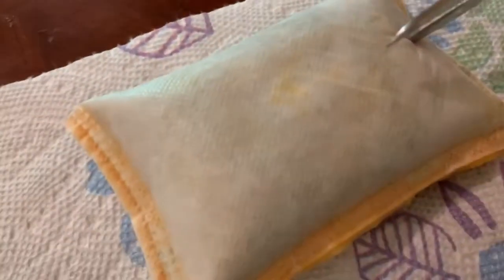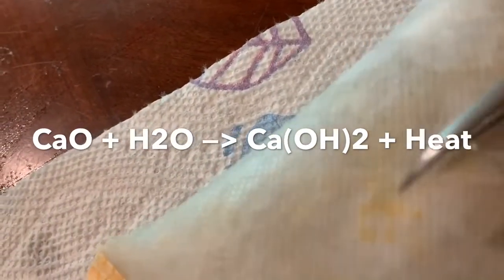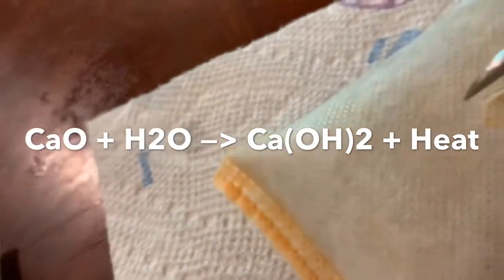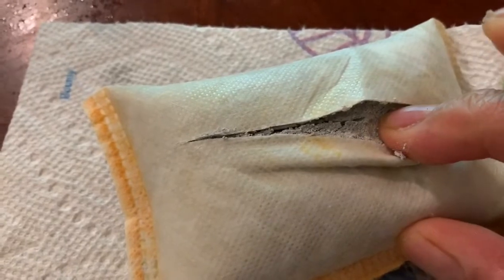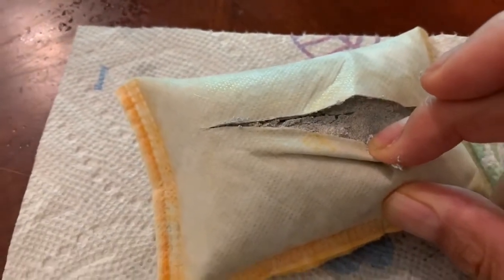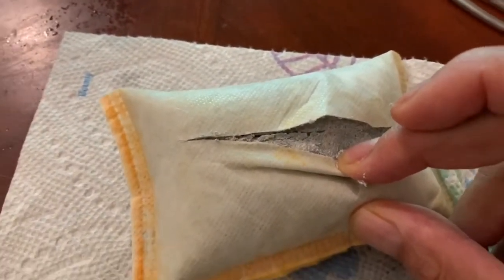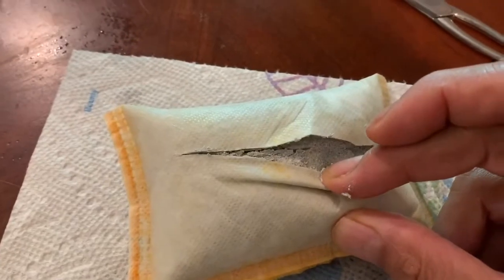It should contain slaked lime, because the process of generating the heat takes calcium oxide and reacts it with water to make slaked lime, which is highly exothermic. Here it is — it's a grayish-white powder, still warm actually, despite more than an hour going by since it was activated. So what I'm going to do in this experiment is take the slaked lime and heat it up to remove the water from it to see if it can be reused for heating again.